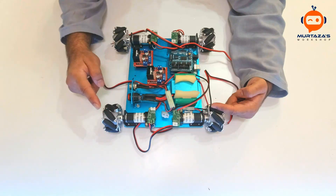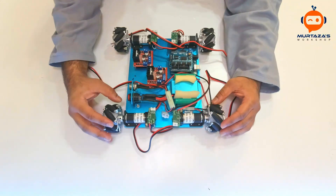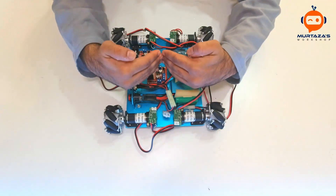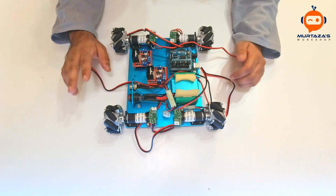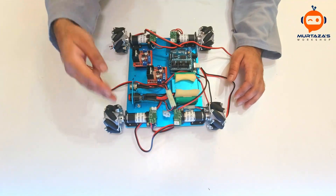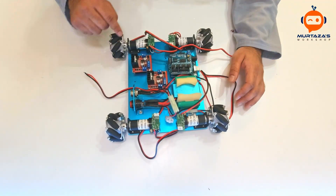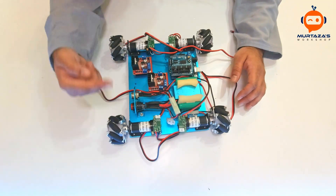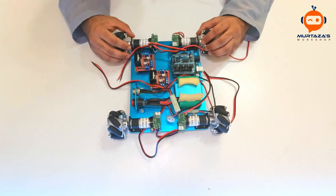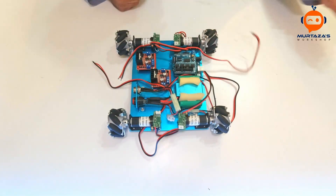This one is also flipped and moving outside, so if we move this wheel over here then we will be in the correct direction — all of them should be moving towards the center. There are two ways to do that: one is to just remove the wheel and place it, the other is to remove the motor and flip it. I don't want to remove the wheel because it has a very small key, and we can easily remove the motors and just flip them. That is why we are doing this now — we also have to cut the wires to the right length, so we will flip the wheels first and then start with the winding. Let's get started.